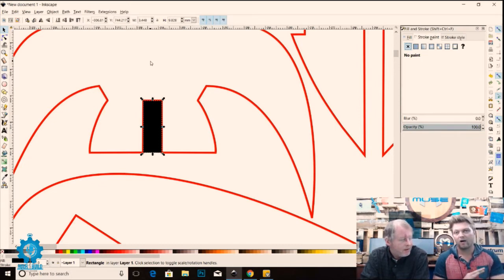Okay. Now, not all 3 millimeter material is the same. Some people will sell 3 millimeter ply, and there'll be a range of thicknesses, even though it's called 3 mil. And traditionally, your quarter board is actually 0.2 inches rather than 0.25 inches. Now, what amazing tool do you use to double check your measurements, your favorite tool of all? Handy dandy calipers. Yes, the calipers. So I always just double check, and when you're moving from material to material using the same file, just double check with this guy.